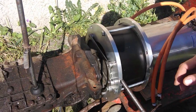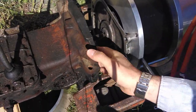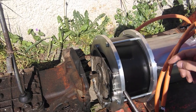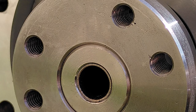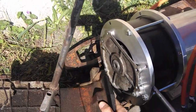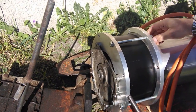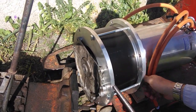I want to show you how I constructed this whole unit, and for that we will take it apart to show you a few features. I will now take the gearbox back a little bit — it might even fall. As you can see, that's the input shaft with the spline there going into the clutch. I had to put a pilot bushing on the motor output shaft in the middle to accept the input shaft from the gearbox side. I will push this out now — so that's the gearbox with the input shaft. This would be the cover of the gearbox going on here, and what I will do is open my transfer box to show you how it is made inside. I'll just unscrew these two here — I just have one hand, so bear with me.